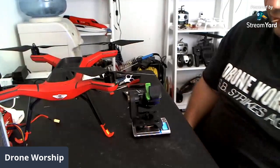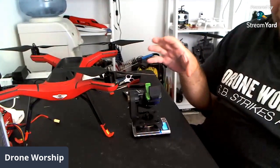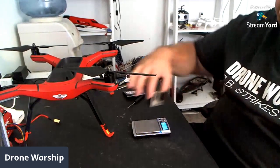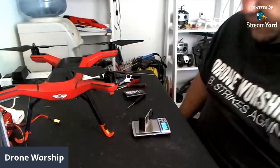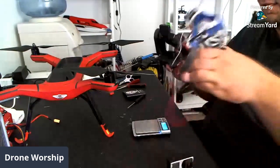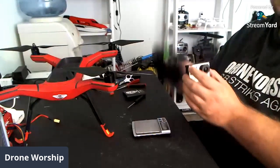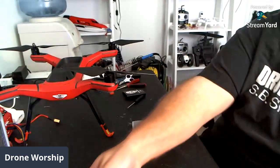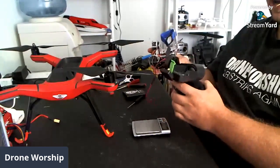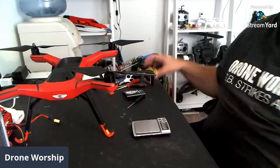So yeah man, there's definitely almost a whole other GoPro's worth of difference — and that's without adding a GoPro to either setup. The stock gimbal comes in at 236 grams. Your average GoPro Hero 4 weighs about 80 grams. So this was almost 240 grams and the home-built gimbal was 173 grams. That's like adding two extra GoPros worth of weight. By doing it this way, the new setup with a GoPro weighs about what just the stock gimbal weighs alone. There's a plethora of reasons why you'd want to go third-party — you can definitely increase your flight time.